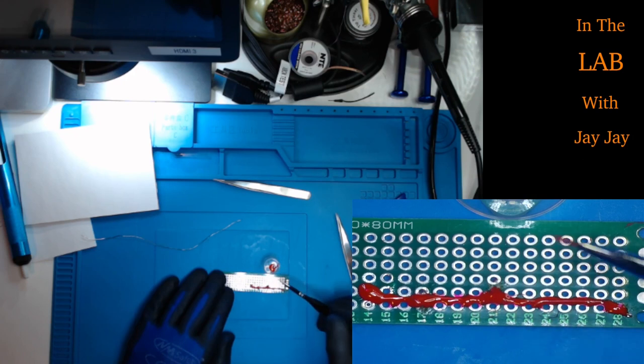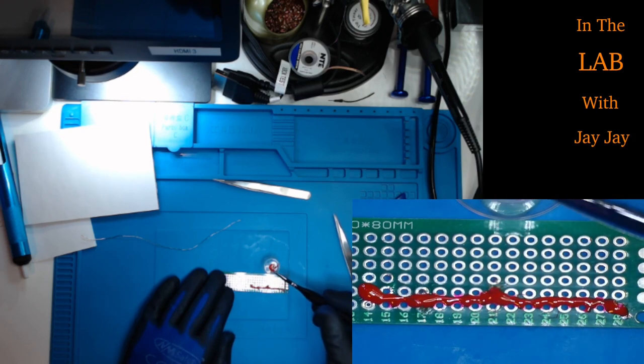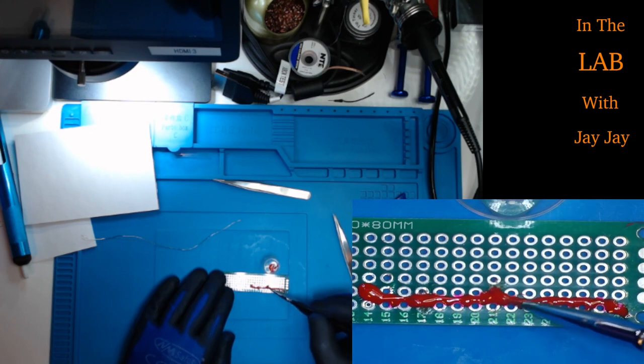It's certainly an option. But I'm trying to do repairs that are, you know, more permanent and perhaps higher quality in the sense that they're safer. So I kind of feel like putting down some insulation around the bodge wire and sort of gluing it into place on the board is a quality thing to do. It's a better type of repair. I don't know if you'd agree with me. I have no experience with this at all, by the way. I'm just figuring it all out as I go along.